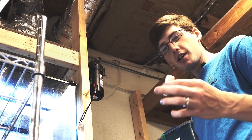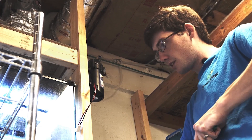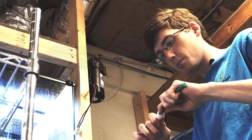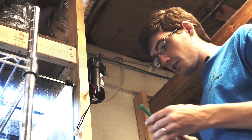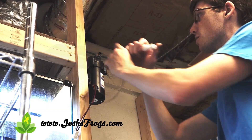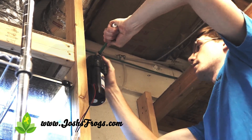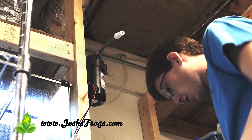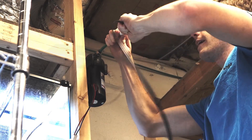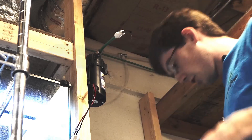For those of you using the larger pump, you're going to need a converter. The advanced misting system, which this is, comes with a converter, but if you're doing multiple, you're going to need to get a 3/8 to quarter inch converter. You can get extra ones at Home Depot or Lowe's. Now we're converted down to quarter inch, and for those using a pressurized system like we are, we're going to add in our solenoid right here.